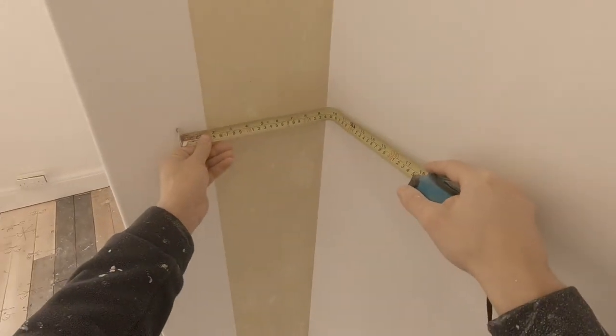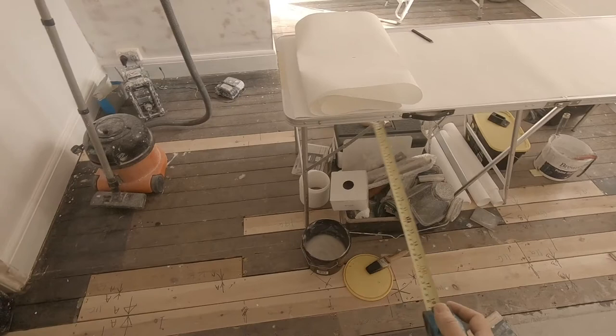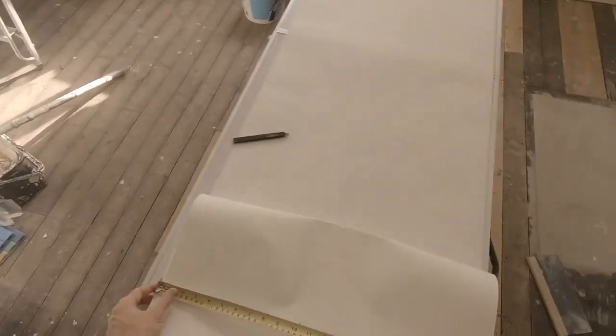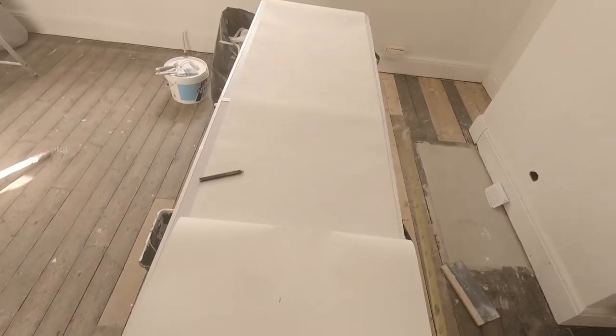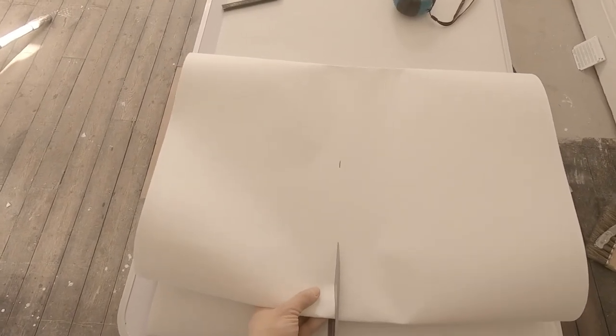The next video as promised - coming around this corner. I've pasted this so I'm just going to lift this away from the wall ever so slightly. I'm going to cut this piece in at 10 inches to give me a little bit of room to play with when it comes to getting around this corner. I'm not taking lines of paper in and around the corners because I don't want to risk them coming away in the future and looking a mess - I want to get right into each corner and have each individual wall as its own papered section. I've lightly folded this piece of paper and measured in roughly 10 inches from the edge, then I'm going to cut straight through all of this paper.